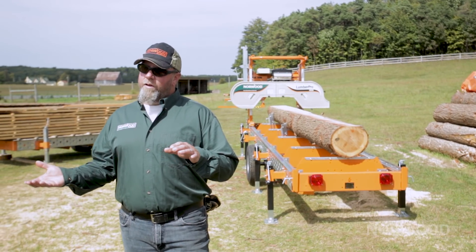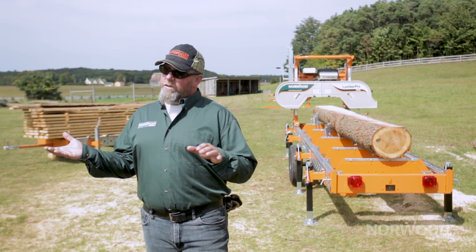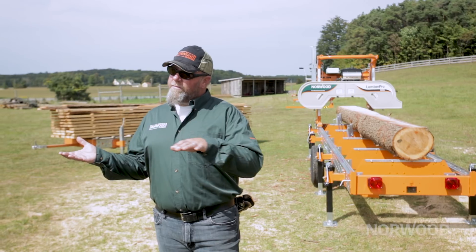What you want to do — if you can picture the tree as a cylinder when it's growing — when you lay it on its side, I know it's not a cylinder, but if it had a bunch of taper in it, you've got to jack that up so that it's level, so that you're cutting in the same exact line that tree grew in in the middle.